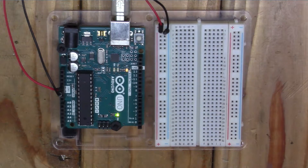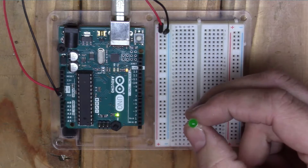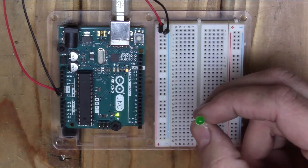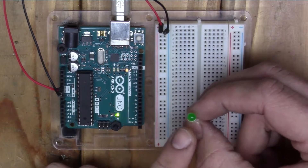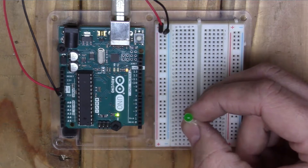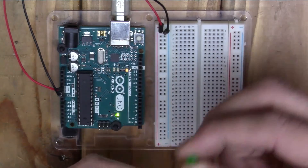Unfortunately I do not have a solenoid built for this motor yet, so I'm going to use LEDs to represent the solenoids, which is a pretty accurate representation. Because what we're trying to do is change the magnetic flux of the solenoid, and the way you do that is by changing the voltage supplied to it. When you change the voltage, you're changing the current, and the current determines what the magnetic flux will be. The same goes for this LED — the more voltage we apply to it, along with a resistor in series with it, the more current flows through the LED, the brighter it will be. The less voltage, the less current, the dimmer the LED. So the brighter the LED, the more magnetic flux in the solenoid, the faster the engine spins. The dimmer the LED, the less flux, the slower the engine will spin.